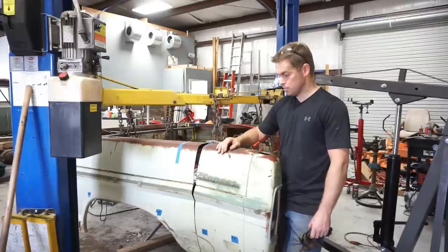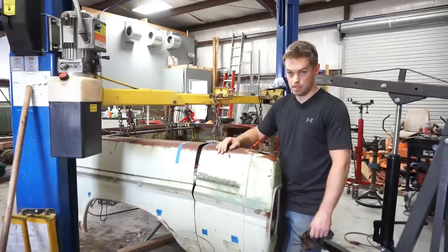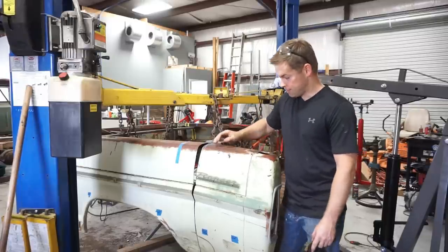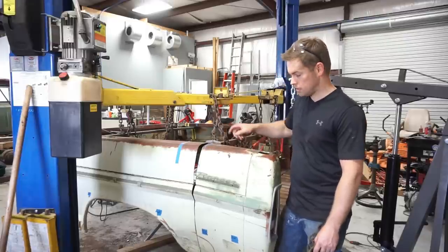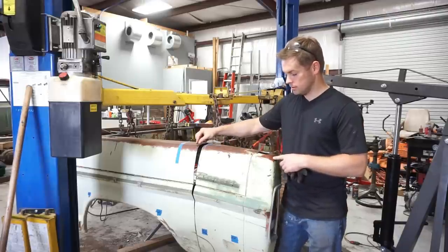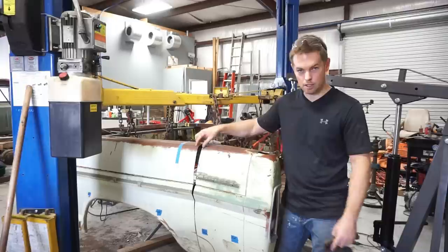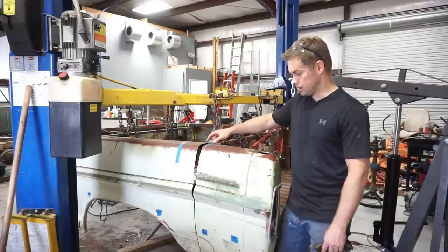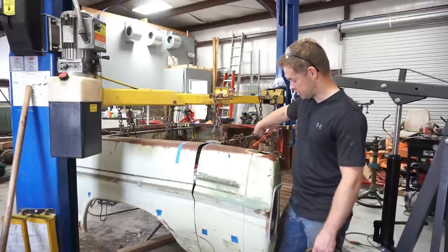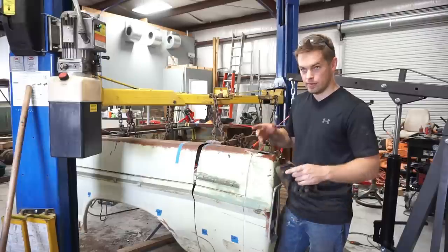And at some point, you've got to decide: can I weld a couple extra gaps, or do I want to just keep on messing with it so I can somehow take a TIG and go down and take that gap? For this truck, I think it's super, super close, so I'm going to take the bed cap off back here, tape off the welding marks, take a 36 grit die grinder and run down the edges, take all the paint and rust off there, and use a tape line to make a nice straight line all the way down, same as you did in the front. Clean it up on both sides, clean it up across the bed floor, and get this thing fitted on there once and for all, and get it ready to start tacking up.